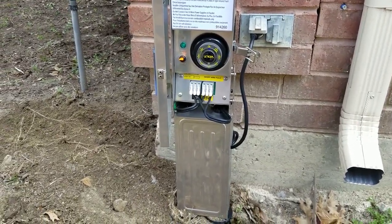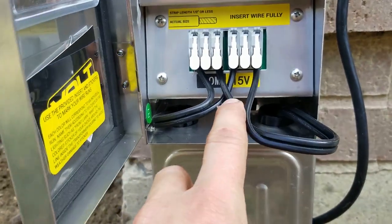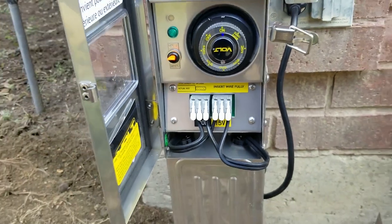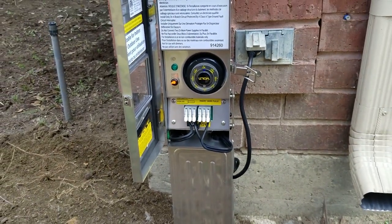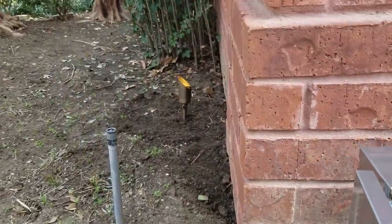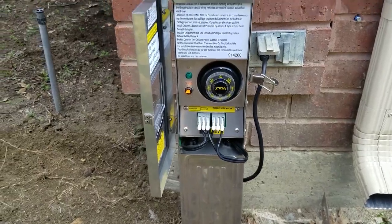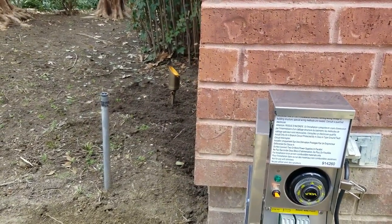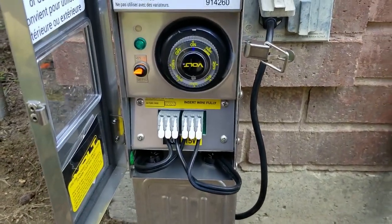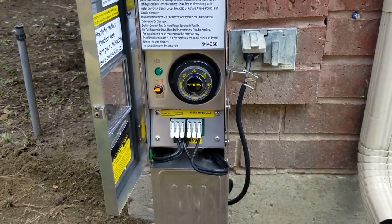A couple of things I don't like about this transformer: one is that it has a 15-volt setting. Most of the time you should only use 12 or 13 volts unless the wire is running a really long distance to a light. If you use 15 volts, especially for lights that are really close to the transformer, it's just too many volts — it will wear out the bulbs and reduce the life of those bulbs significantly. I don't know why they built some of these transformers with just the 15-volt option.